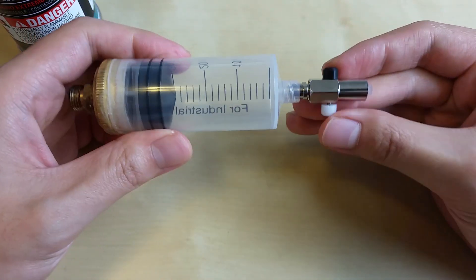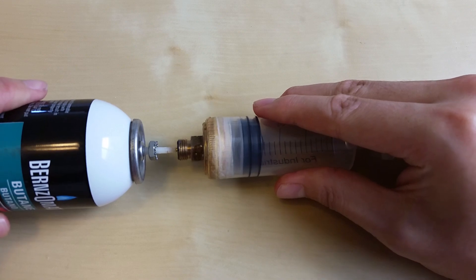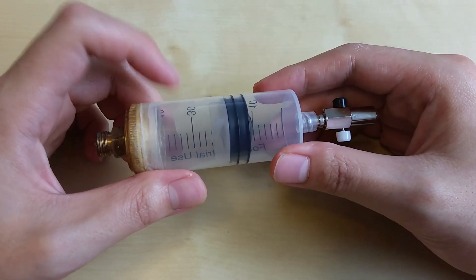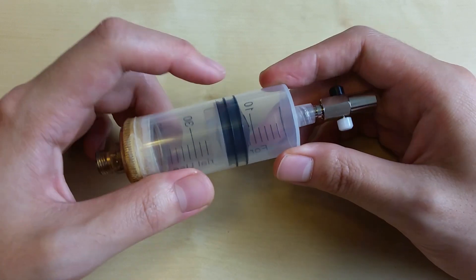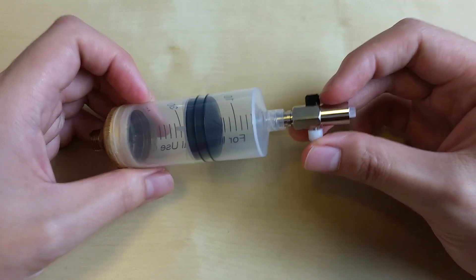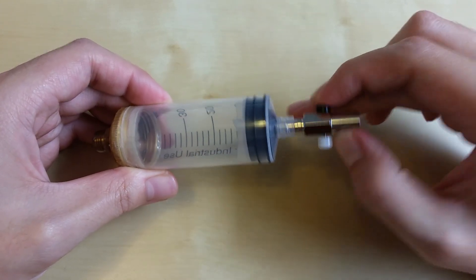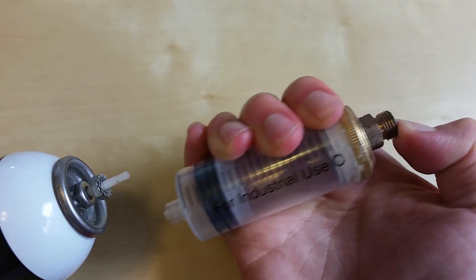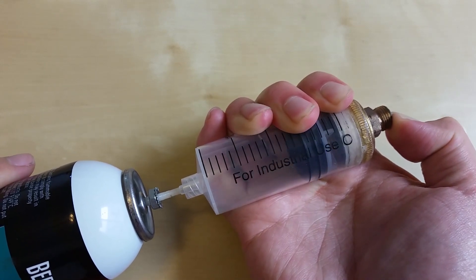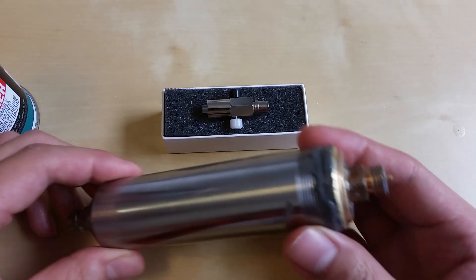Let's take a look at what's going on inside the fuel chamber with this transparent model. In the finished version, there's going to be pressurized butane on one side of the chamber and fuel on the other side. The plunger allows the butane to exert pressure on the fuel without mixing with it. This button opens the syringe valve, which controls the flow of fuel. To reset this demonstration, I'll push the plunger back towards the bottom of the syringe with butane. I press on the valve in the back to relieve the pressure behind the plunger while using butane to push the plunger down. Now we're going to do the same thing to the fuel chamber to reset the plunger position.